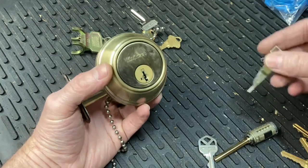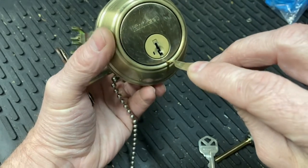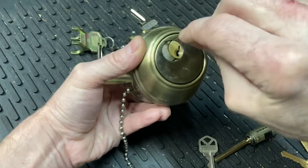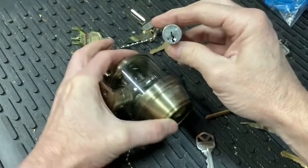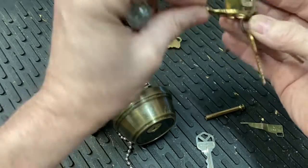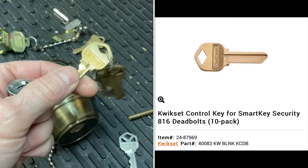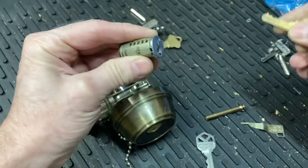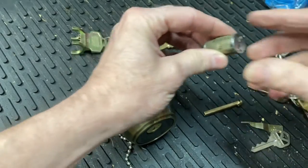The situation I've figured out here is on these there's a little slot right underneath and you just rotate that around, and right above is the other keyway. It came with this key right here, which is a different key than Kwikset normally has — it's actually a control key style, and that's what it says: do not duplicate. I believe the key number is like a 40081, and that's what works for this, but it will not fit your normal Kwikset key. It's a different keyway — it's a control key — and they make that just for these deadbolts.